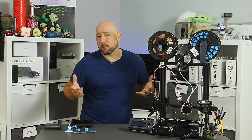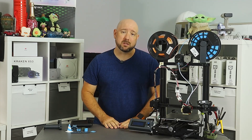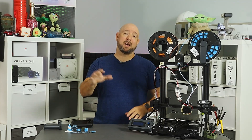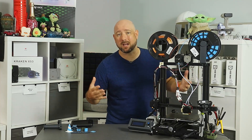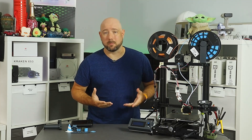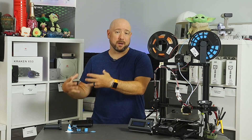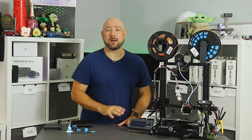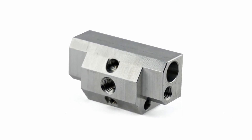It's pretty easy and works pretty well, but it's definitely not foolproof and even well-adjusted nozzles can struggle with stringy, curly, or otherwise difficult filaments. Once you have the nozzles level, it's just a matter of adjusting retraction to keep the inactive nozzle from oozing filament all over the place, or possibly adding an ooze shield to catch some of that ooze as the non-printing head re-enters the printing space. E3D also sells a two-in, one-out hotend called the Cyclops, in which the two filament channels feed into a single heater block and merge into one nozzle.